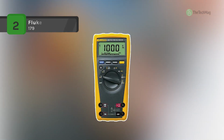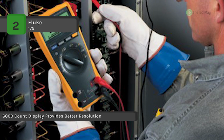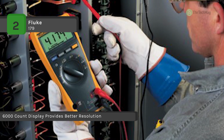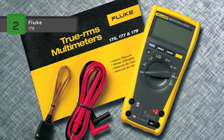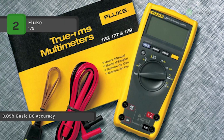The Fluke 179 offers a digital display with analog bar graph and built-in temperature measurements. It includes a built-in thermometer to measure temperature without having to carry a separate instrument. Also, it delivers accurate true-RMS AC and voltage plus frequency, capacitance, resistance, continuity, and diode measurements. Besides, it increases productivity with manual and automatic ranging, display hold, auto hold, and min/max average recording.